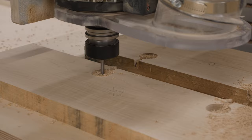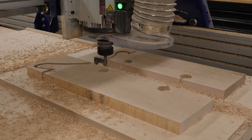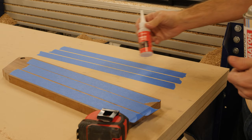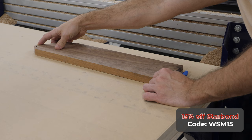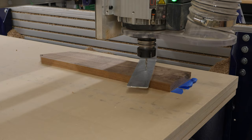After that's done, the machine is going to cut the top profile of each half of the wings, and you see it's also cleaning up the side — that's going to give me a really nice glue surface. With the locating features cut into the wings of the guitar body, it's time to make the mating pieces that will help to align everything. I'm holding this in place onto the vacuum table with some blue painter's tape and Starbond CA glue — this is my go-to method for smaller pieces, it makes the process really easy.